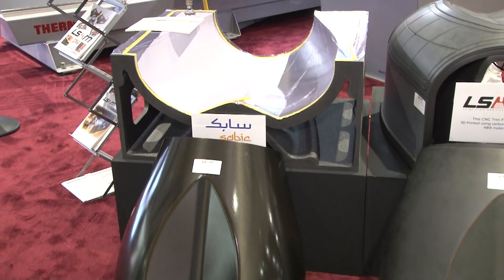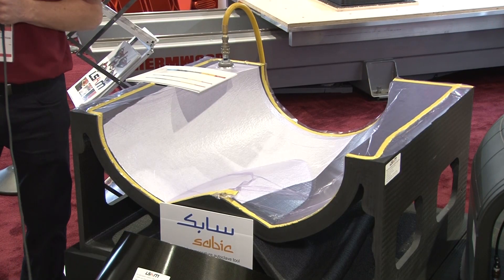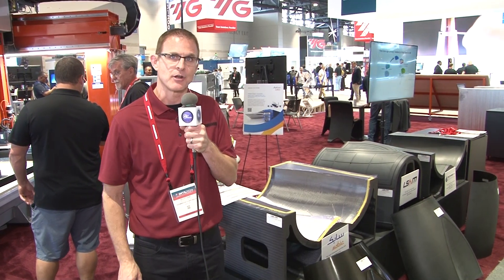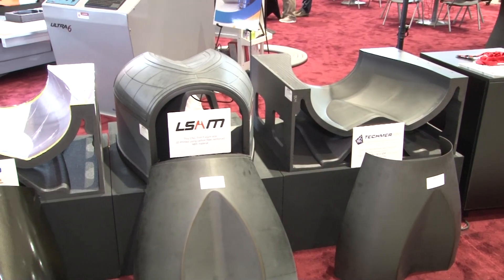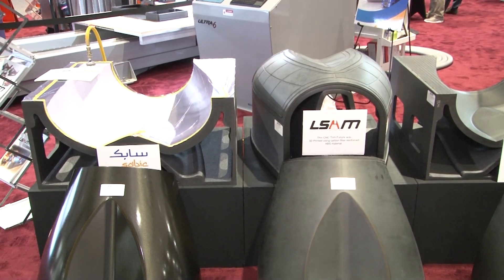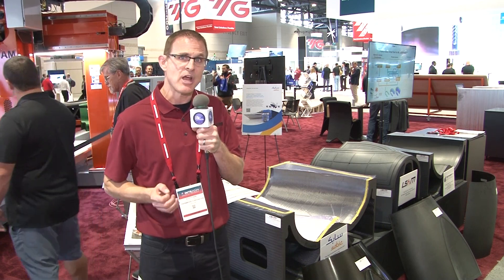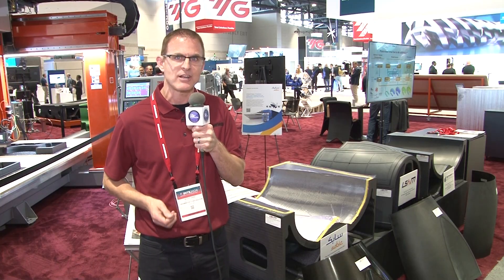With the capabilities from the LSAM Research Laboratory and the CAMS Consortium at Purdue University, these tools have been correctly compensated for anisotropic CTE and other shape changes that occur in the autoclave tooling cycle. With all these capabilities, the Thermwood LSAM is capable of creating first-time right printed tooling that has vacuum integrity directly off the machine and produces dimensionally correct finished parts.